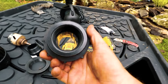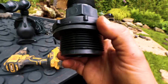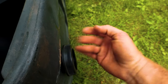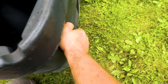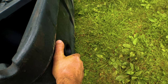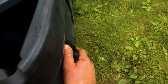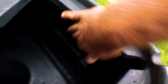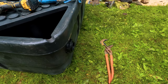That's the right size for the inch-and-a-half bulkhead to slide right through. One very important thing: this bulkhead has a rubber washer that must be on the inside of the basin, where the water will be. Bulkheads are reverse thread — lefty tighty, not righty tighty. Get it snug by hand, then with channel locks give it just a quarter turn further. These can be over-tightened and you can break the internal part of the bulkhead, so just a quarter turn past hand-tight is all you need. That pulls the rubber washer tight against the side of the basin — watertight.